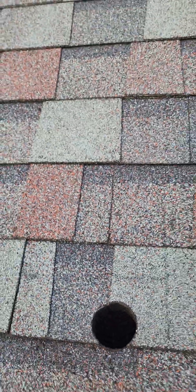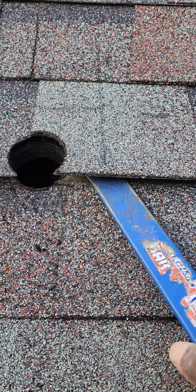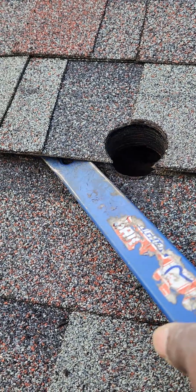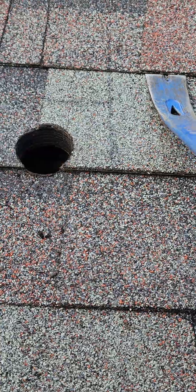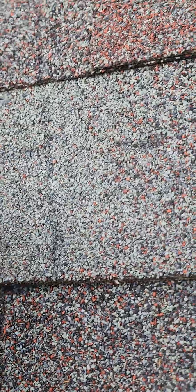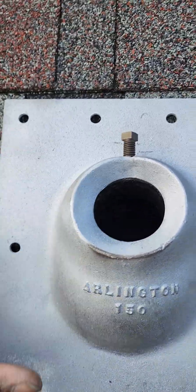Couldn't hold the phone in during drilling because my drill bit was kind of dull. So after we find that, we go ahead and lift up this section of roofing shingle — just that one section. This has already been raised up; normally it's pretty stiff and hard to move. Then we go ahead and position our roof flange, our flashing, over our hole.